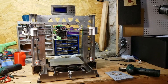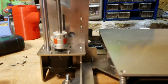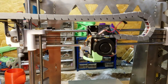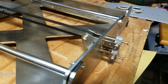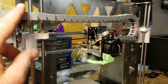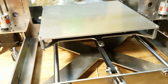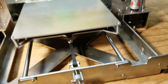We've got the A8 built on the Tatara frame. We've got new couplers, we've got the bed, the belt nice and level. My X chain mounts nicely, but I could not use the Y chain — it was rubbing right there. I had the Y chain where you mount the bed on the side, so I'm going to have to look for a redesign or do something else. For now, I just don't have my bed hooked up — I'm not going to be using it much anyway.